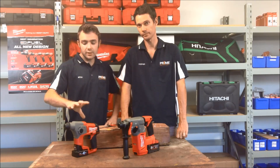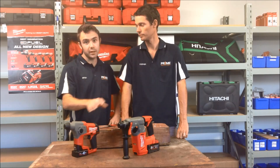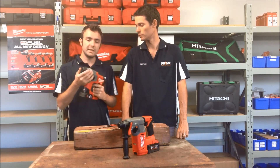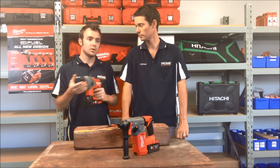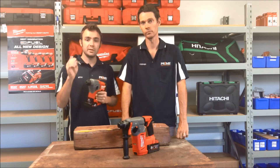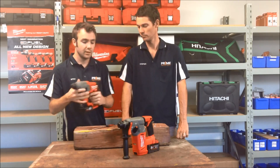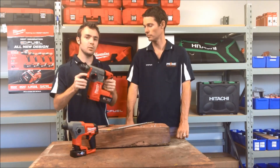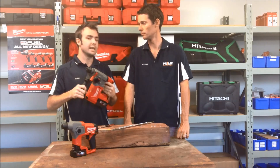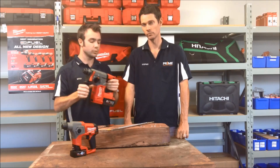Hi Steve. These tools are most commonly used for electricians, plumbers and building and construction trades. Notably the M12, it's got a 16mm drilling capacity, so you're targeting guys who are going to be using 6, 8, 10mm drill bits, drilling in wall plugs and small fixings and fasteners. Whereas the M18 has a 26mm capacity, so it really thrives in that 12, 14, 16, 18mm range, which is good for your dyna bolts and light construction sort of phases.